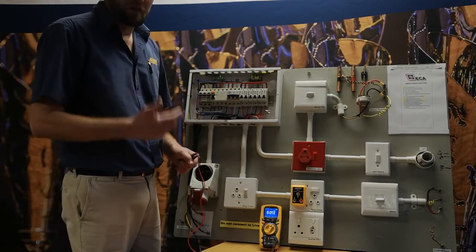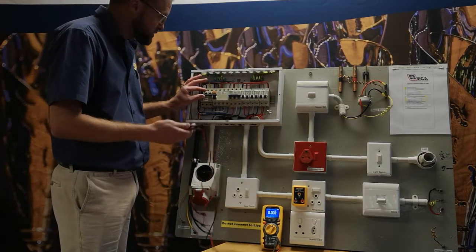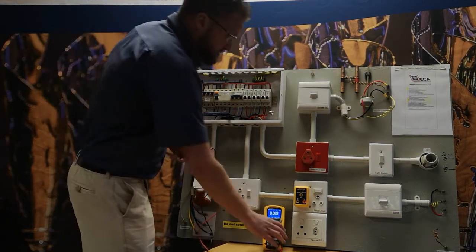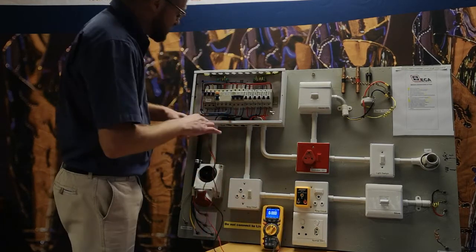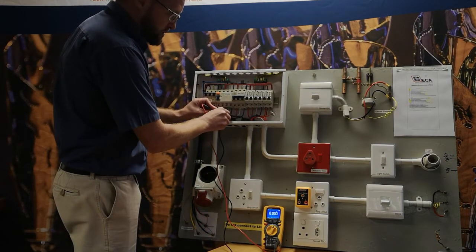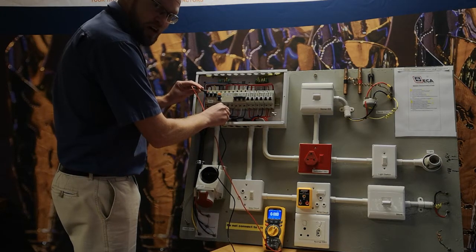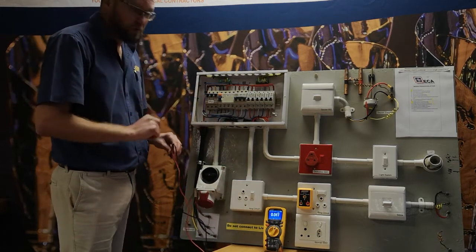The next test is voltage, full load. Make sure at your main sub-DB board or wherever you want to test it, you get your maximum load — your mains must be on and everything must be on so you can get your maximum load. It's the same as the no-load test: switch your multimeter on, put it on volts, go to your supply neutral, short your leads out, make sure your meter is working, then from your main supply neutral to your incoming live you can test it. Make sure on your no-load and your full-load test, on the nominal voltage, there's a 10% up or 10% down tolerance when you measure it.